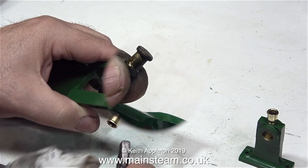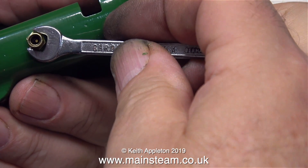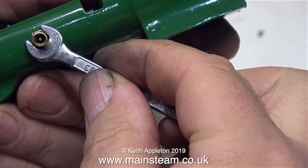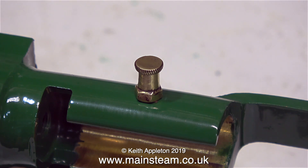On this engine there are three oil cups - there's one for the crosshead and this one has a cap on it. I cleaned it up on the polishing spindle, and in this clip I'm fitting it to the crosshead guide, being very careful once again not to mark the paint. This oil cup is not quite as 100% clean as the others, but I didn't want to round the hexagon.